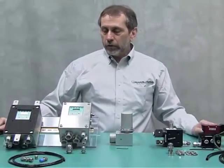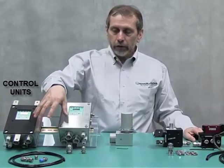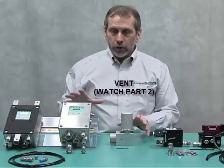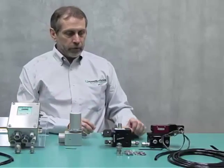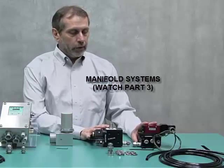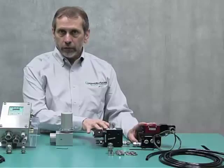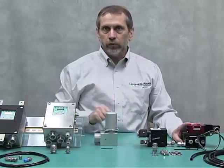That completes the explanation of the components for the 5500 Series System. We have the control units with mounting hardware in external and internal mount configurations, the vent which is a pressure relief — both required for the Type-Z EXPZ system. We also offer optional manifold systems for purging and pressurization of the enclosure. You can use manual valves or your own valving system, because the purge flow is based on the pressure inside the enclosure, which is measured through the control units.